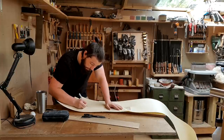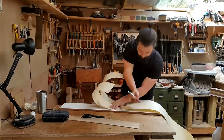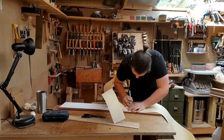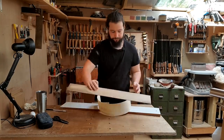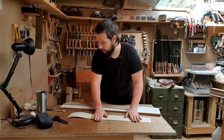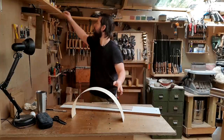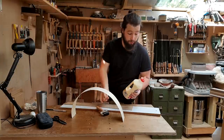I can do this real rough — that's pretty fine. I'd rather glue it onto the oak a bit oversized than undersized. This veneer is nice; it's actually got a paper backing on the back of it which helps with the gluing process.